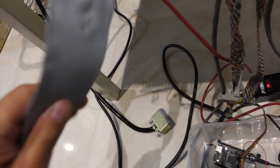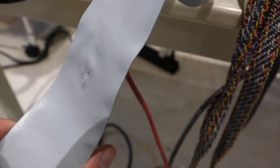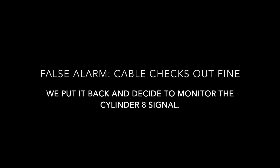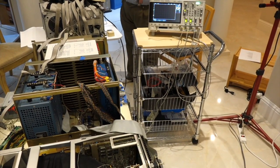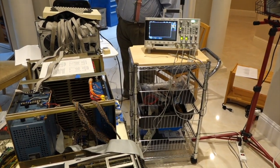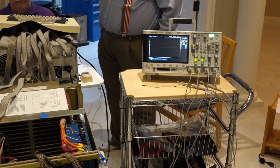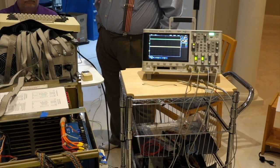I just noticed on the cable there's an exposed wire right here, and it looks like we crunched it. Let's check that. We checked the cable that looked bad, but actually the cable looks good. So now we have hooked ourselves up to the lines that define the seek to cylinder 8, to see if the computer is actually sending the wrong information to the disk.